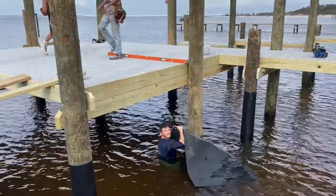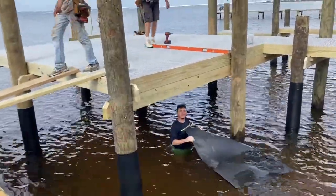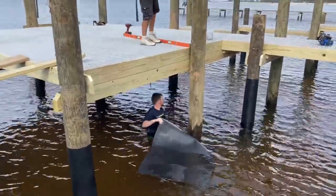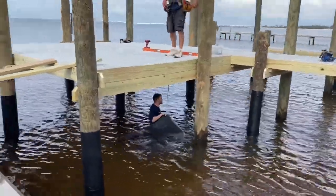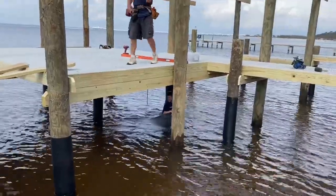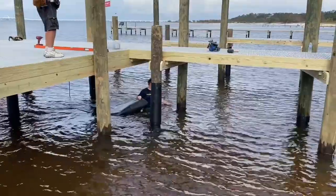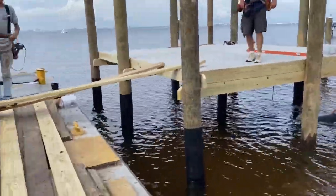If you come across one that doesn't have any piling wrap down on the bottom side of it, we'll have to jet a little hole around it and get the piling wrap shoved down about a foot or so in the ground. They all should have the lower section of piling wrap installed already. Okay, it might be one of these poles over here. If not, well, we did put the first wrap on every single one of them. Right. So I think we had ordered one more pole that did not have wrap on it.